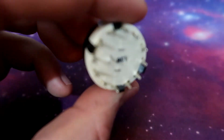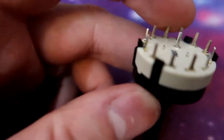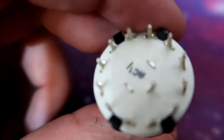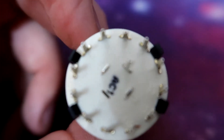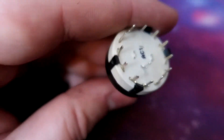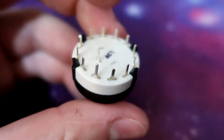Here's my 12-pin rotary switch. You can see in the middle we've got that selector pin that runs to the blue wire, which goes into the analog input on the Arduino, and the rest of the pins are our selection positions. Where the selector is positioned determines which voltage point connects through those resistors.